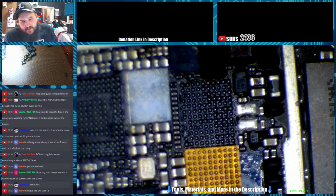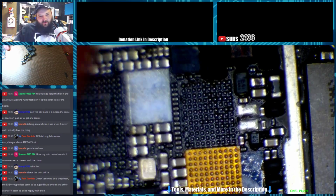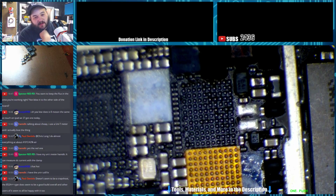The heat sinks in it aren't as big as the Quick, but they're also on a separate board from the control board. The Quick is one control board with the switching MOSFETs and everything all in one. This one has a power board and a control board separate. I'm sure that probably helps keep some heat down, especially not having the LEDs and stuff on the same board.